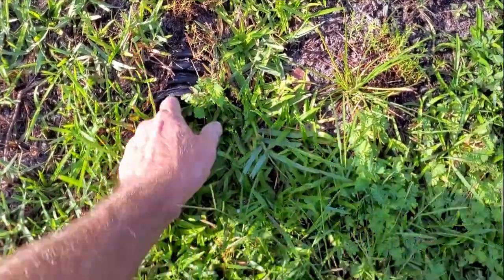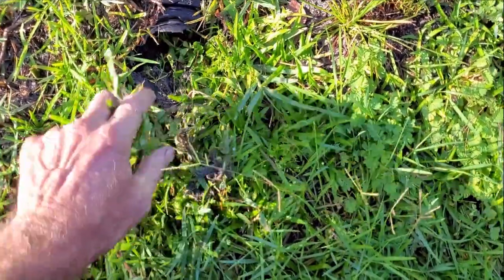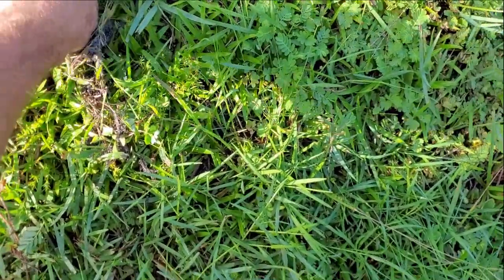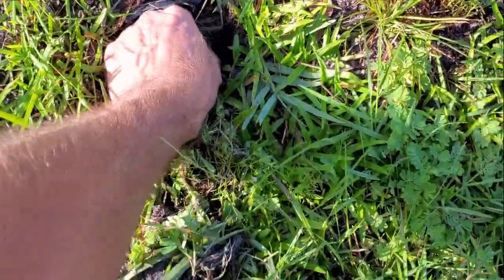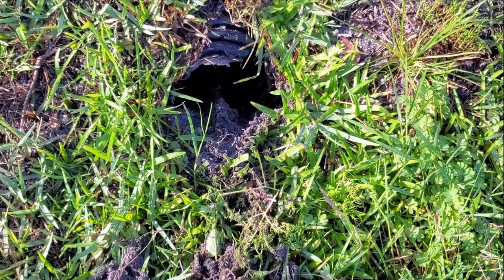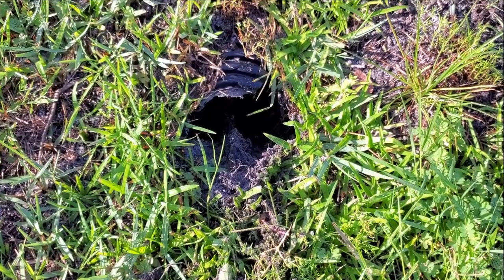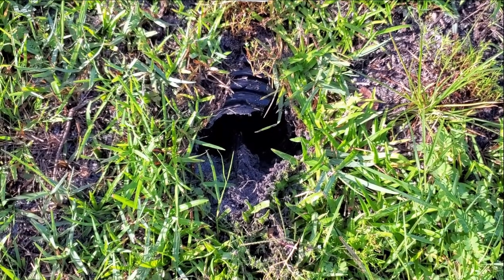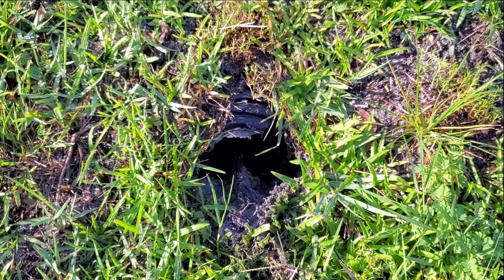Here's the pipe — you can see it's kind of overgrown. So we found the end of the line. I'm just pulling out a little bit of debris here and you can hear it down that line. That pipe's super clean. We'll send that cable all the way out here to make sure we get a good flow. Then next, we're going to go ahead and show you how you clean this with a jetter. A lot of people say don't use the jetter in a French drain, but we're going to show you that they're wrong.